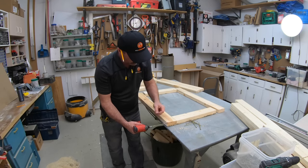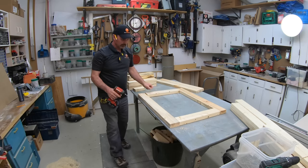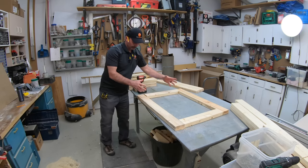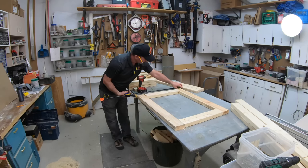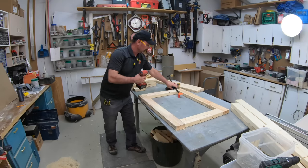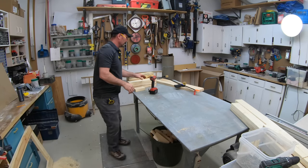I'm flushing up this end and the top. These are five-inch screws — five to six inch would be good if you're doing the same kind of design. I'm putting them in a little bit countersunk. If I didn't pre-drill, these ends would likely split more times than they wouldn't — that's why I pre-drilled most of the way. A clamp comes in handy to hold things together when you're working by yourself. I'll mark an X on the inside so I don't get the good face mixed up.